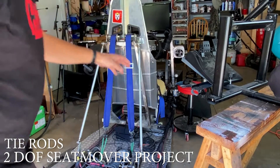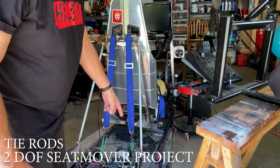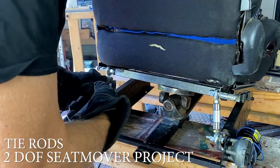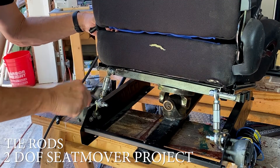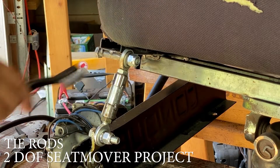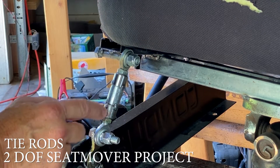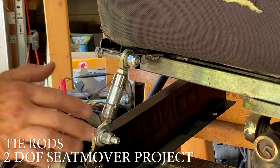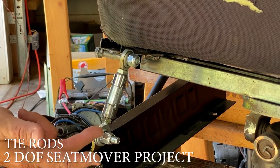I know these are real small, so if you take a look at my three degree of freedom build, those things are like 31 inches — it gives a lot of mechanical advantage to those big motors. But on this thing, I'm moving the whole frame and not just the seat. This is a flux core welder, so you're always going to have some dust or crap come off when it's welding. If you have a gas welder, you won't have to deal with all the residue from the flux core — it'll just come out way nicer. These tacks should be just fine, and if they're not good, you can just grind them down with your angle grinder and use a vice grip to pull the thing apart again and reuse it. I've used this particular set at least a couple of different times.